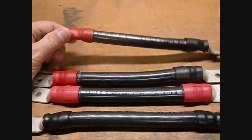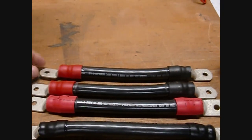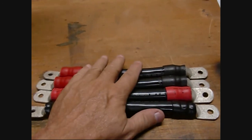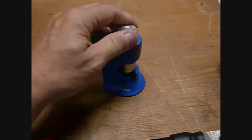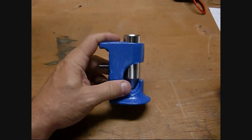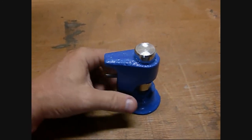There was a place online that I found. They would make them all up with 4-aught cable — which is as fat as you're going to find — with 5/16ths holes made exactly for my battery bank terminal spacings. These were only $8 a piece, and they literally were mailed the next day — all pre-made and ready to ship. The other nice find from this company, since I do have to make some other longer cables, is a cable-making crimping hammer for my terminals. You usually see these on eBay for $25 or $30, but this guy sold it for $12. Another example of where you can get better prices if you look around and not depend on those eBay suppliers specifically.